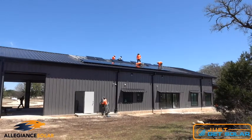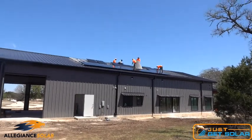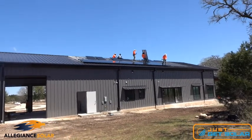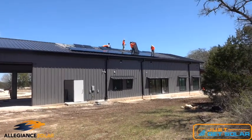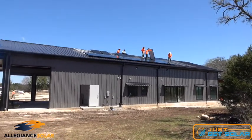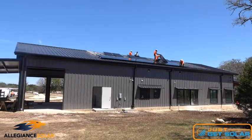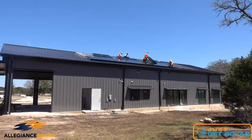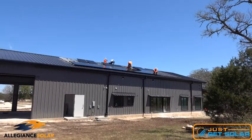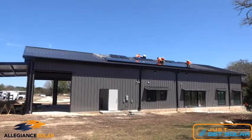It's a myth that people say, 'I want solar so that when the grid goes down I'm okay.' I talked to a gentleman yesterday who got a quote without batteries, and the salesperson told him he'd still have electricity even if it's rainy and snowy for five days. That's not true if you don't have a battery — and five days is a long time to go without energy.